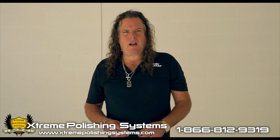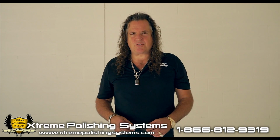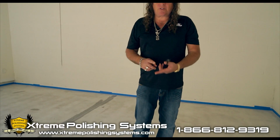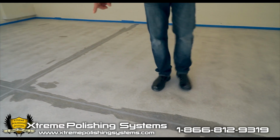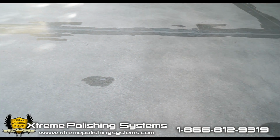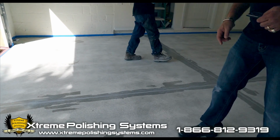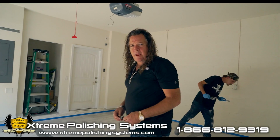Well, as you can see, Dr. Jimmy and Dr. Jeffrey here, I should say Professor Jeffrey because he works at the Pompano University, they've filled in all the voids of the concrete now, so that all your construction joints are filled, all your little divots have been filled real nicely, as you can see. What you want to do is make sure that the whole surface is flat, so when you put your epoxy down, you know what I'm saying? It's a self-leveling epoxy. You don't want to see any type of lines going down the middle of the floor. So they've done a real good job here. We're going to give them an A+ for that.